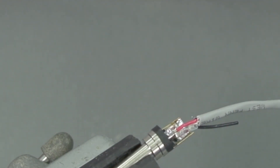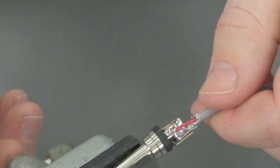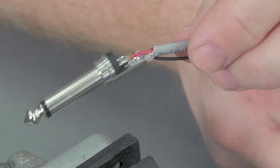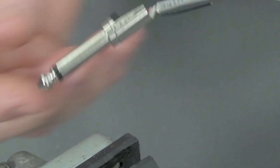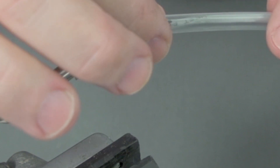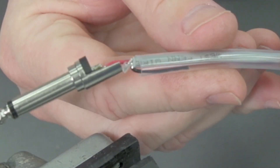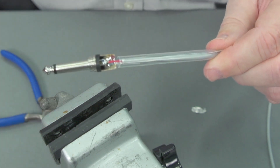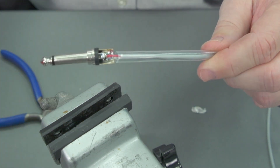Cleaning up the iron, tinning the tip, and putting it back in the holder. As I put this together, I want to make sure the black wire comes up underneath the heat shrink so that I can use it in the future if need be. I'm going to go ahead and bring the heat gun over and shrink this down.